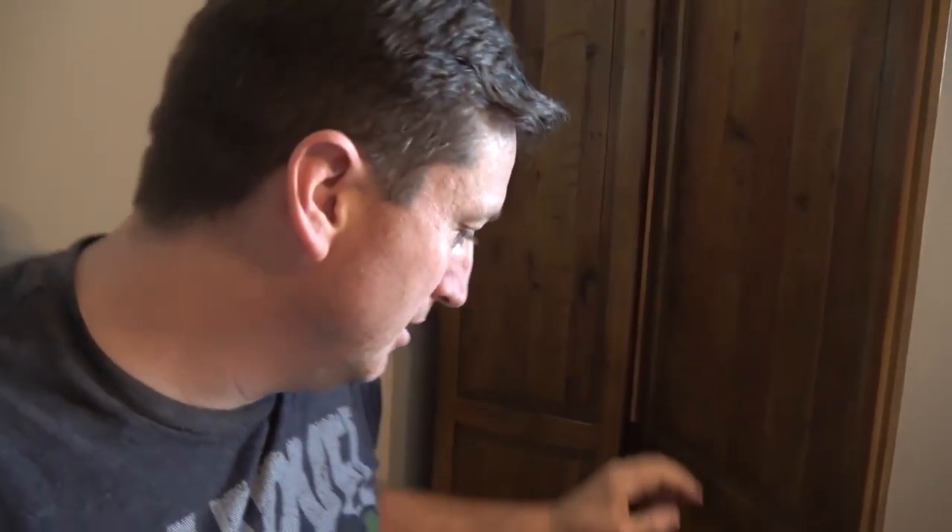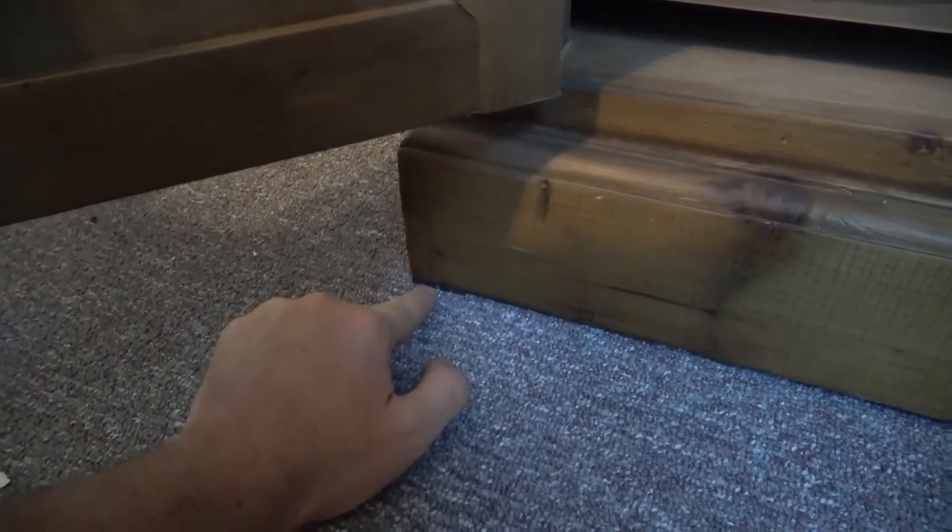It has been on the to-do list to put these cabinets into duty for ages. The trouble was — I've already done it now, but I'll show you — you see this gap against the wall? It leaned forward a little bit, so if we were to load it up with stuff it would have the risk of toppling down. So I bought these shims, put them underneath. They're not much to see, but there's one right there, there's one right there, and so on.